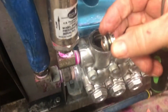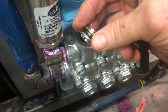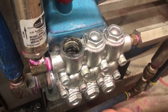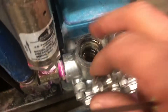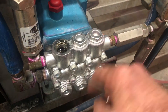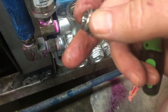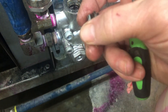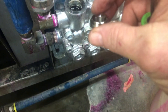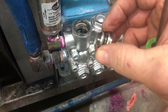Okay, this is it. That little white ring and black ring are the seals for this valve — that's what I'm going to be replacing. You'd have to go through each one of these; there are six of them. When you open these, all the water that's in here will drain out, along with any debris. It's probably good before you start putting them back in to open the water and let it flush this area out. There's a little debris piece on my finger — there's a lot of hard water that builds up and creates problems. Debris gets stuck under these valves, leaves them open, and they won't have the pressure you want. That's basically what we're doing — replacing these seals so you can have the pressure you want.